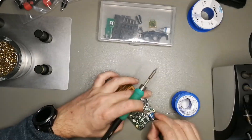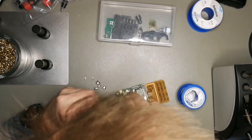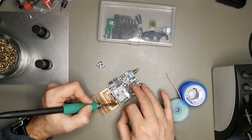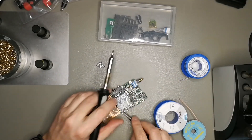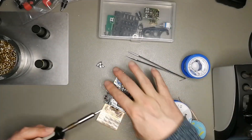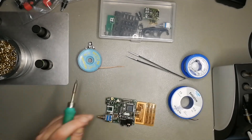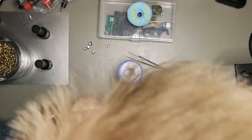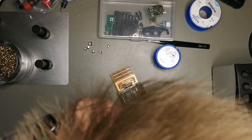If you use enough flux and have two soldering irons — and if the solder is not so good, heat it before and apply a bit of fresh solder — that technique works quite well for me. Of course a proper JBC luxury soldering plier with two heated prongs would be much more convenient — you just go with the plier to your capacitor and pick it off the board. But that way also works; it's less elegant, but for my hobby purposes it works.